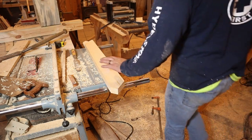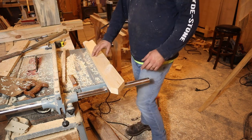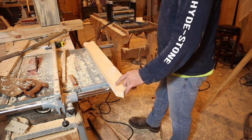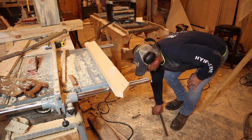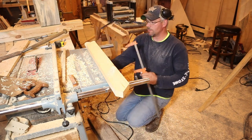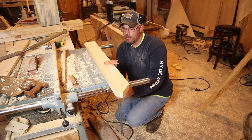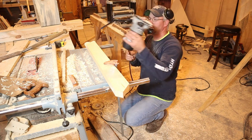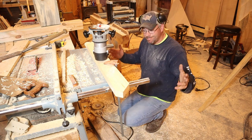There are a few ways to cut these tenons. You can cut with a saw and clean up with a chisel or slick. You can cut them on a table saw — works very well as long as you can hold it nice and square. What we're going to do here, because it's only three-quarters of an inch deep, is hit it with a router. We'll leave a little bit of a line so we have something to trim to when we finish. It really helps to clamp the workpiece down well. I already have the router bit depth set, so I'll ease in and go slow.